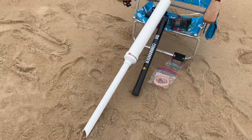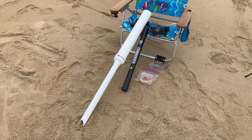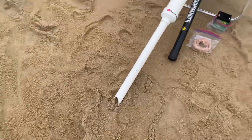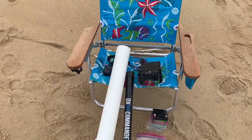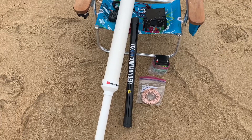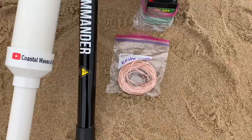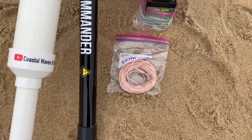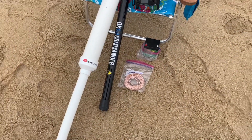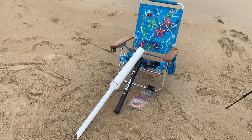Okay, here's what we're working with today. If you saw my last video, I made this sand spike — basically a three-inch PVC pipe with a reducer down to a two-inch PVC pipe. I did a little mod on it: I cut an angle in it to help get it into the sand easier. I'll have my Xiegu G90, so I'll be running 20 watts. I have the DX Commander travel pole, which gives me enough room for a true half-wave 20-meter vertical. I've got the wires already cut — one cut to half a wavelength for 20 meters in the general portion, and also a 5% counterpoise. There's my battery. So there's the setup. Let's put it all together.